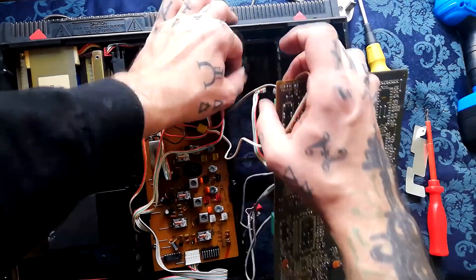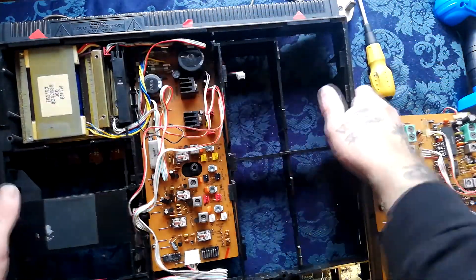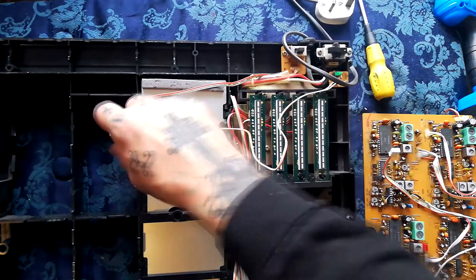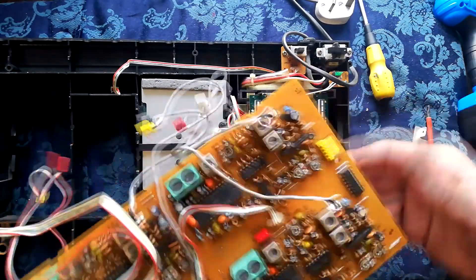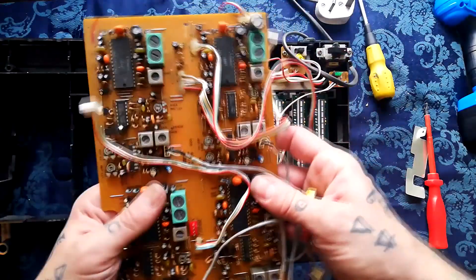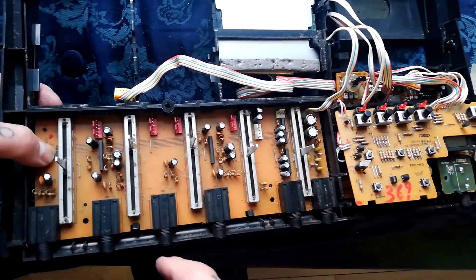Close off. See what remains: power input coming from this board here - that's a yellow two-pin header. Then there's a three-pin cable up here - I'm pushing at it with my left thumb - that pulls off from the front. Let's find out where that cable is connected; it's running all the way along here to this switch. That's the Dolby noise reduction switch, and it was coming through that slot there and turning to the record/playback amp in that corner. That would give us access to any soldering we needed to do.